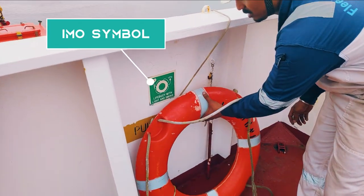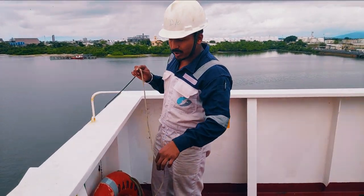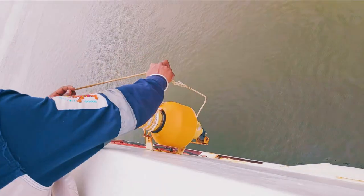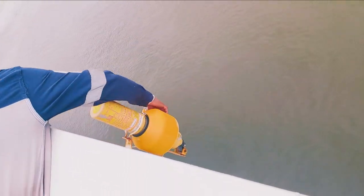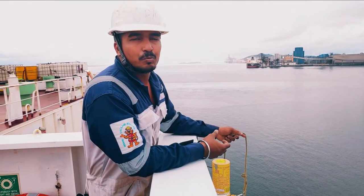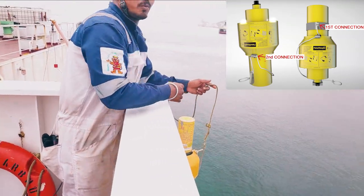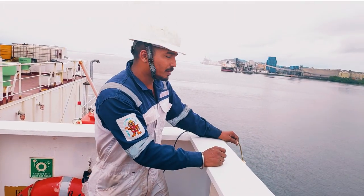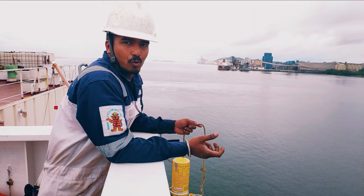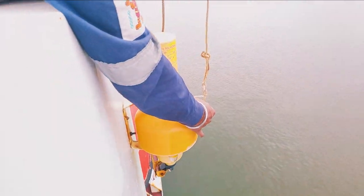Then we will go for the connections. This line is connected with the buoy and the second end is connected to the ship. It is connected at two places. First, it has a smoke signal inside - there is one which releases the smoke. Once you pull the pin, the life buoy will fall into the water. With the weight, it will first release the pin, and simultaneously it is going to release the smoke. The second connection here is connected to the actual MOB body.